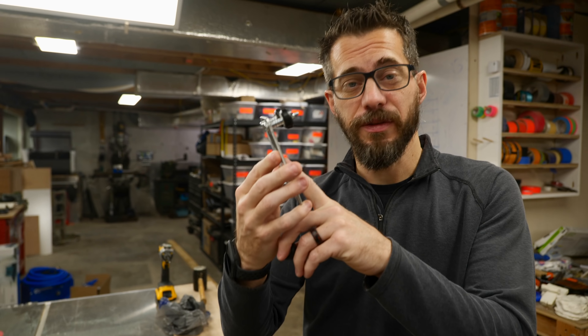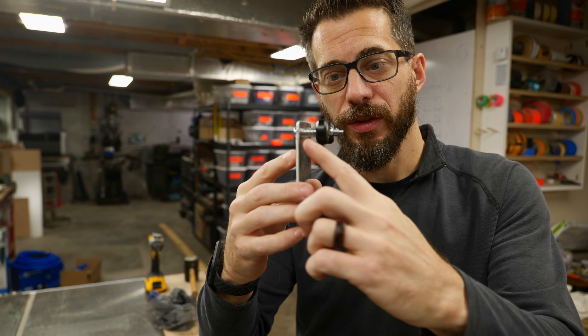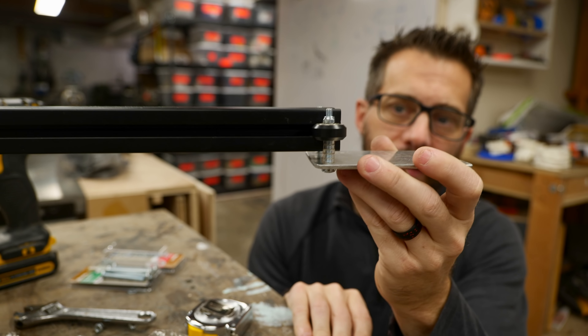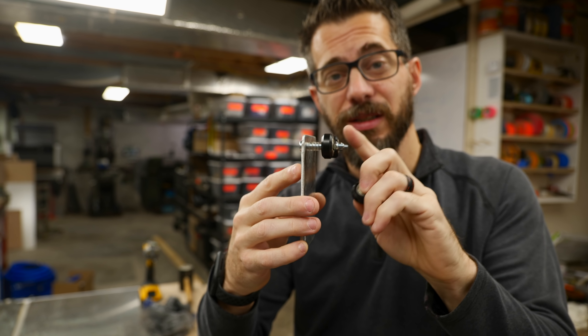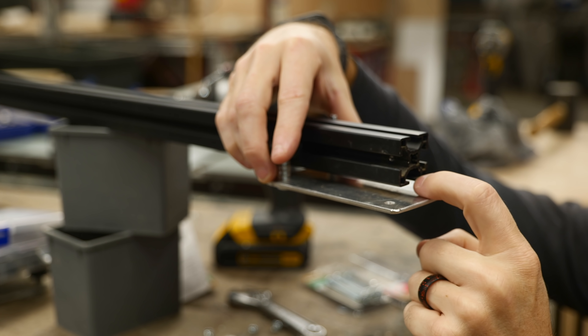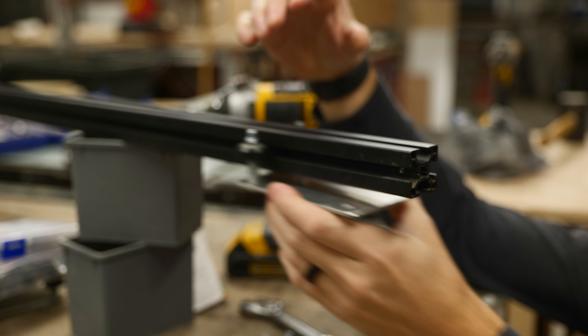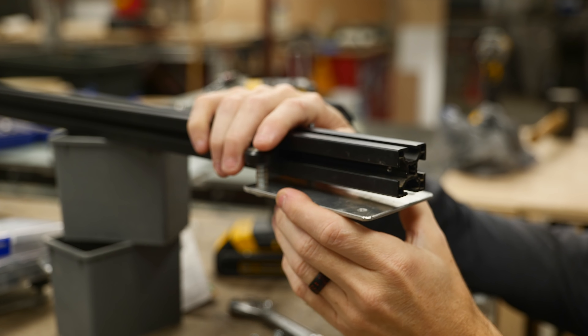The track for this is actually just a piece of aluminum with some holes drilled in it, and I've got a bolt running through some spacers that I made on the laser — they're just kind of like thick washers and those go to the wheel. These wheels have a little bevel on them which makes them fit into the slot on the side of the extrusion so these things are captive once put on. You've got enough gap underneath to put the head of the bolt so it can come down and the arm can mount here and slide back and forth. I'm not adding a brake to stop it from sliding on the track because once we get it into position nothing else should move it. Before I put the other two wheels on we're going to drill the hole in the center and put in a quarter-twenty bolt so we can mount the arm when it's done.